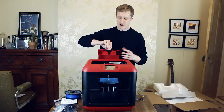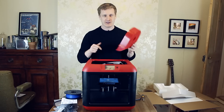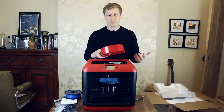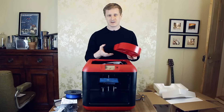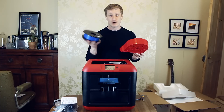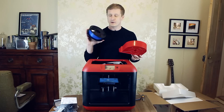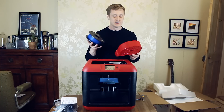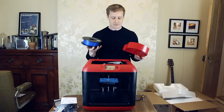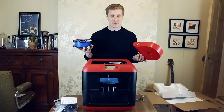The Finder has this handy little tray for putting filament in. This is if you're using their filament, which is pretty cheap. Not knowing too much about 3D printing, I think £12 for one of these is all right. This is 600g of filament, so 0.6kg of 1.75mm PLA. I think that's okay, but it might not actually be cheap for everybody. So I'm going to figure out how to put this in here and I'll get back to you.